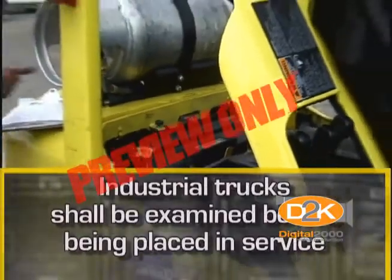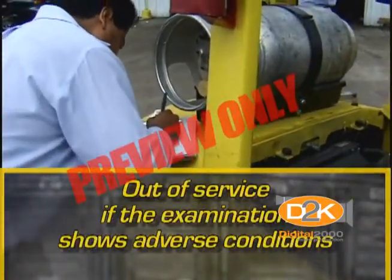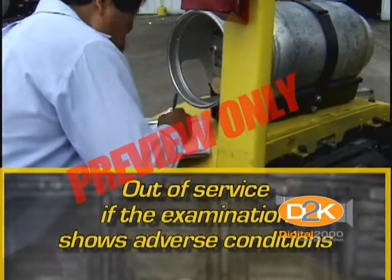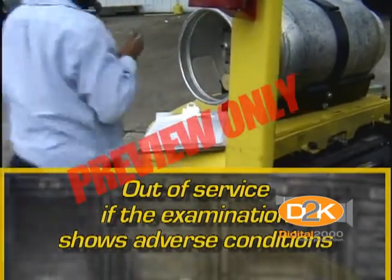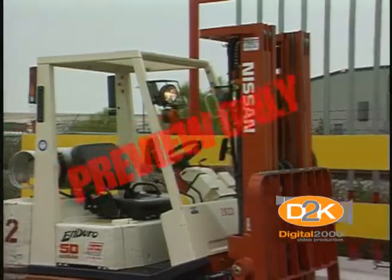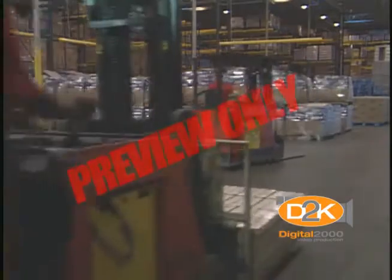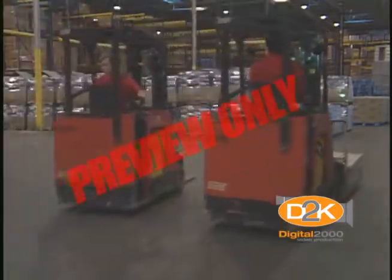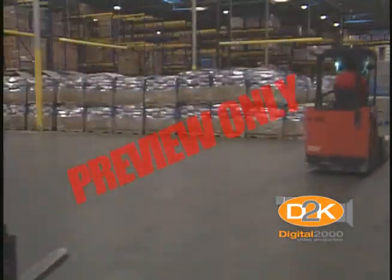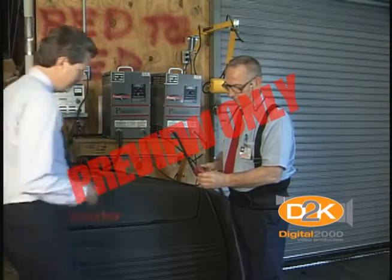Industrial trucks shall be examined before being placed in service and shall not be placed in service if the examination shows any condition adversely affecting the safety of the vehicle. Such examination shall be made at least daily. Where industrial trucks are used on a round-the-clock basis, they shall be examined after each shift. Defects, when found, shall be immediately reported and corrected.